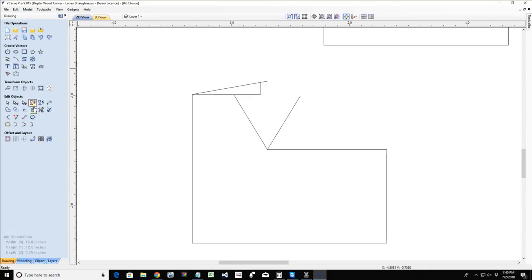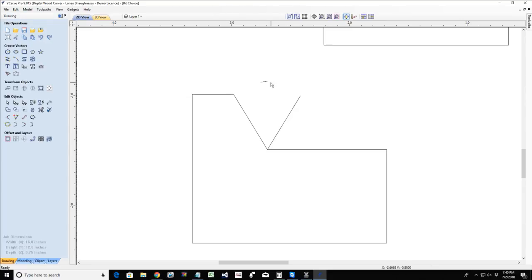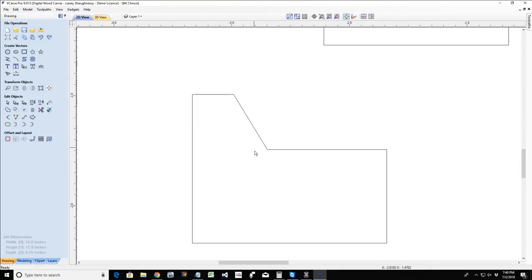It's going to remove that tear out. It's going to clean up that edge when it's doing that V cut, so any tear out that would have occurred by my end mill is going to be removed. So you always run your pocket cut first, because your V-bit is going to come back and clean up those edges. And hopefully that answers that question for you, Peter.